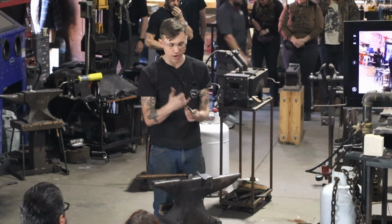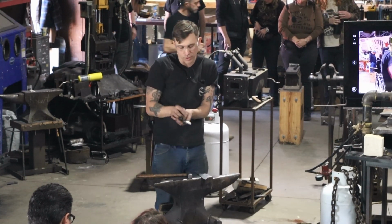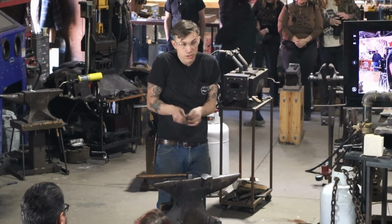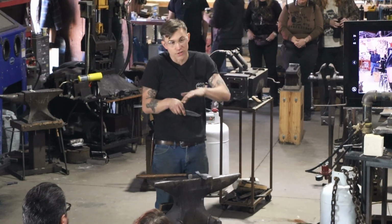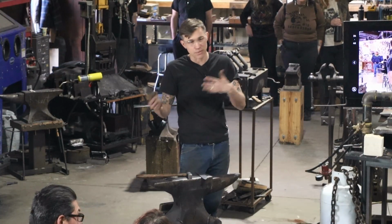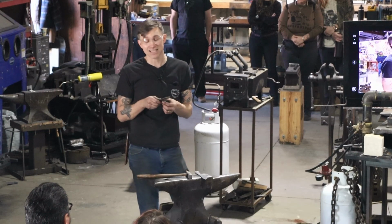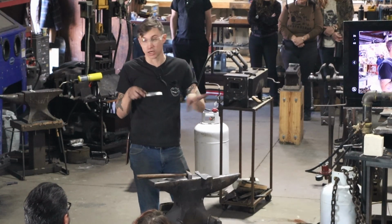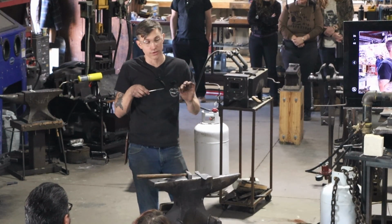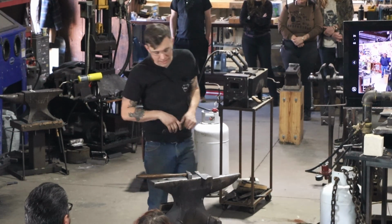A bushcraft type blade that has more of a blunt tip, that has not as tall of a bevel, you can still bring that down almost to a zero edge. If the overall geometry is correct, you can do that and get away with it. And the same thing on a kitchen knife. It's like, man, that kitchen knife can about be dull. If it's nice and thin, at least half an inch above that cutting edge, or maybe a little higher, real thin, it's going to pass through that apple. It's just going to go through because it's real thin, and it'll be easier to sharpen.